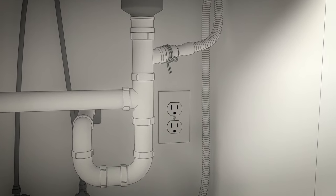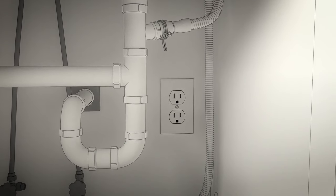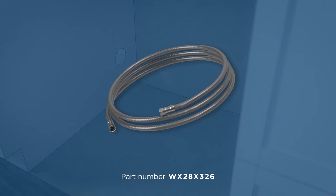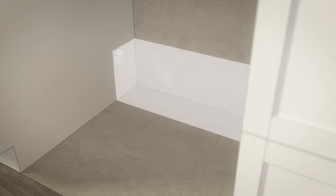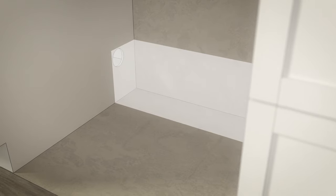To prepare electrical wiring, please consult a licensed electrician or see the installation guide for complete details. Next, it's time to prepare your hot water line. We recommend ⅜-inch copper tubing for the water line, but you can also use the GE Appliances flexible hose. The line may enter from either side, the rear, or the floor within the highlighted area. It may pass through the same hole as the electrical cable or drain hose, or you can cut an additional 1½-inch diameter hole for it. If you use a power cord with the plug, the line must not pass through the power cord hole. If you use a flexible supply hose, label it with the installation date to use as a reference. Flexible hoses, elbows, and gaskets should be replaced in 5 years.